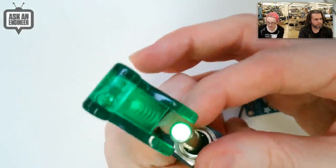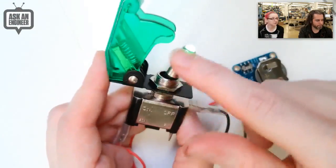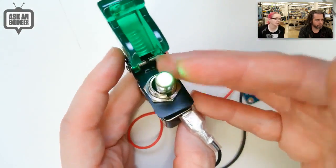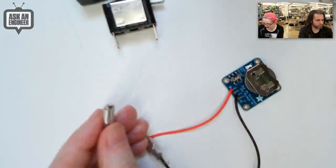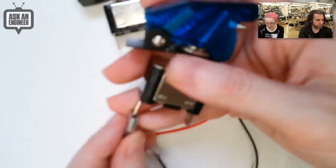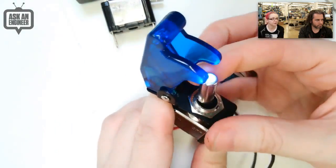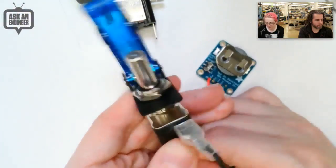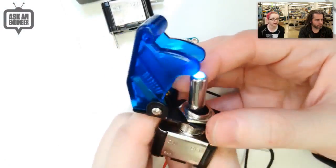It's really lovely because it's got this nice diffused LED. I'm powering it from a coin cell, but you can actually use up to 12 volts — there's a little resistor inside. So you can theoretically power this up to 12 volts, it'll get brighter, but it still won't be blinding. This is green. And then I've got blue — a nice diffused blue LED at the end. You can have the LED on all the time or only on when the switch is on.